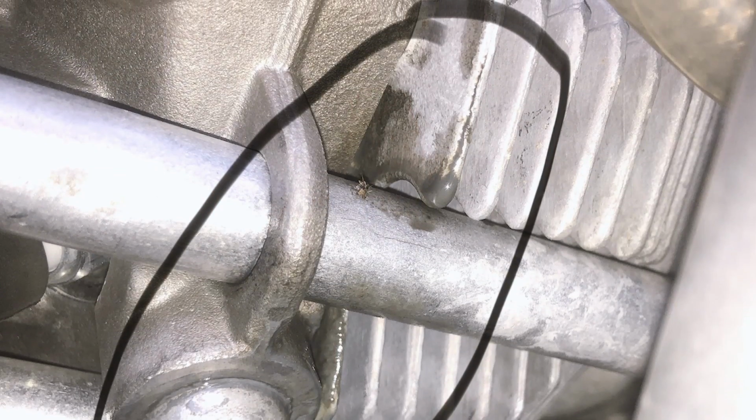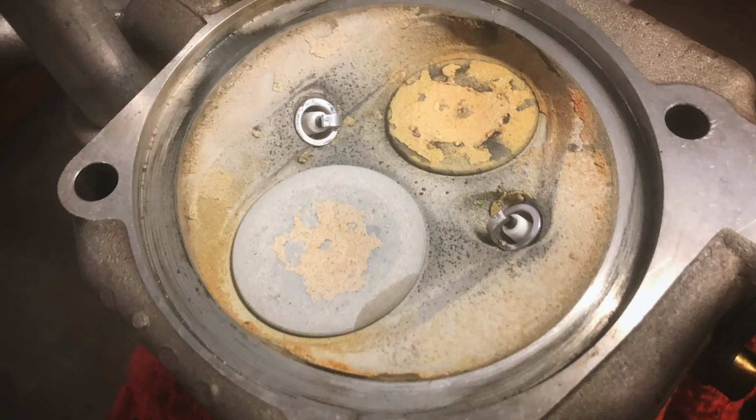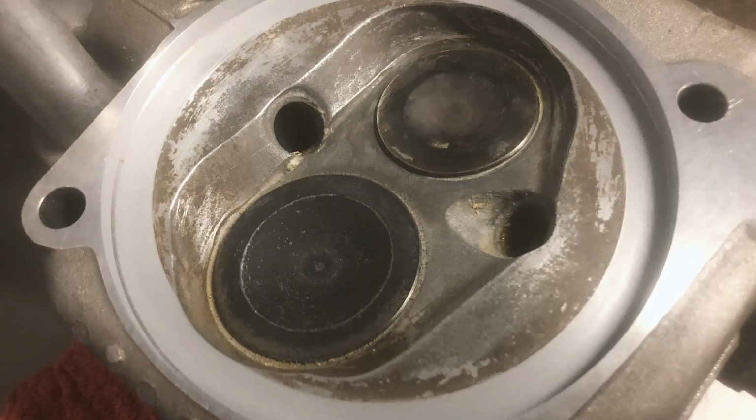I like to do that around 200 hours to make sure everything is working well. During the engine inspection, I found a small leak on my cylinder number 3. My mechanic suggests we take it off and do a lap around the cylinder edge to create a better seal. I had the same issue on cylinder number 2 last year, and I haven't had any issues since.